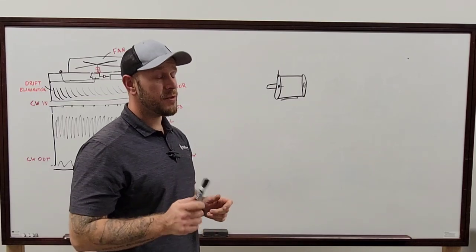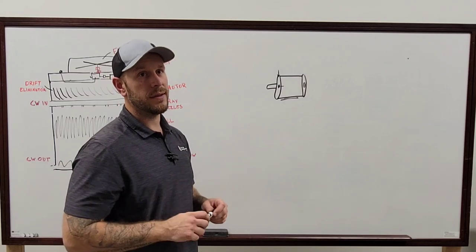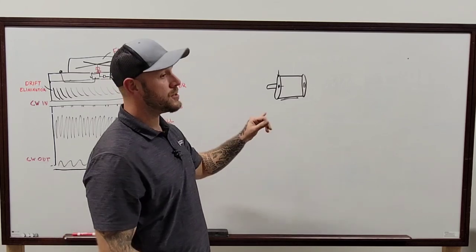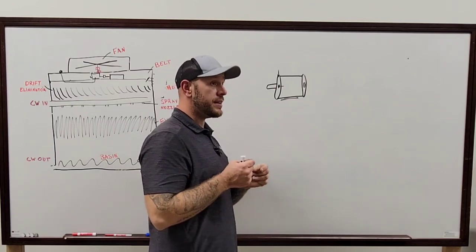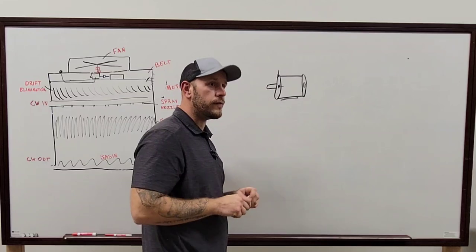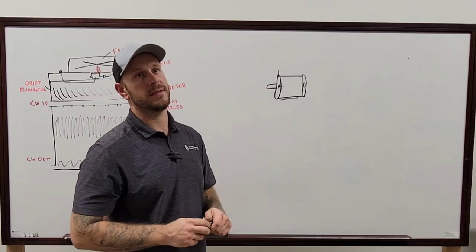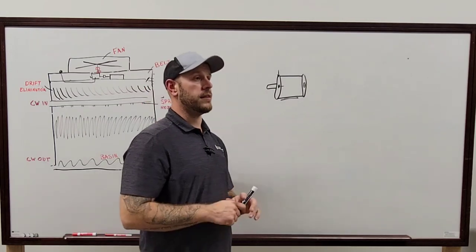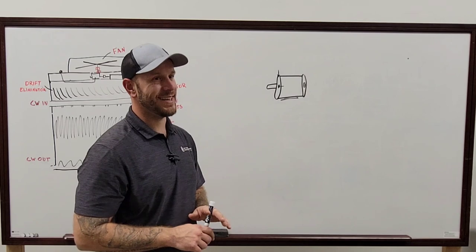Exactly, and most of the time they're tapered to the point where you can't get the pulley any further if you don't do it that way. When you go through the threaded portion of the bushing into the threaded portion of the pulley, that split that's inside of that bushing is then no longer at zero, if you want to call it. It is off, and you will never get it to sit straight, I promise. Especially if it's already sat there for God knows how long, you won't be able to fix it.